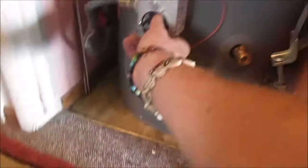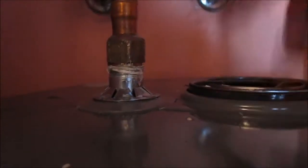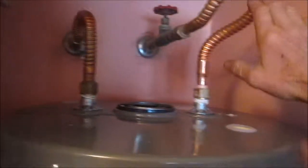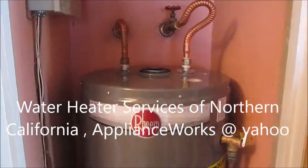I'd like to give it a quick check. These apparently are self-cleaning — it's always a good idea to just put a torque on the nipple, maybe factory torque, double-check all your fittings. We're going to have to cut the vent because the vent is a little bit shorter since the other one was a little bit taller. I managed to salvage these with no major kinks, so we're good there. When we install the clamps back, we're ready for hot water.